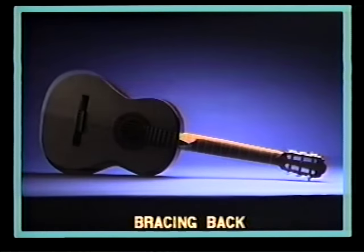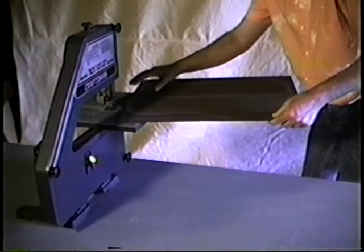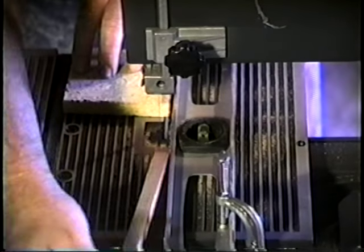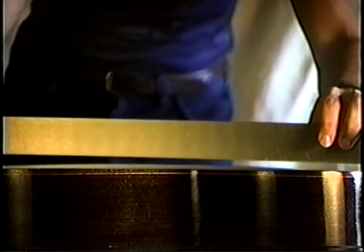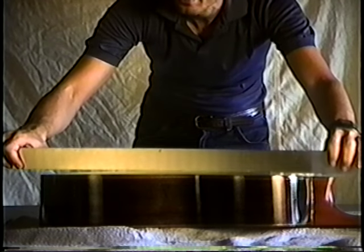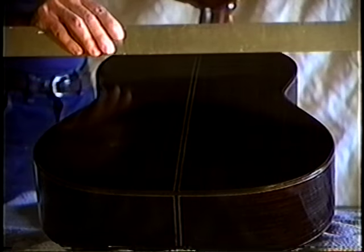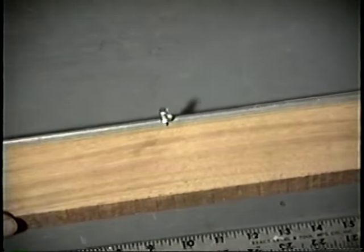The function of the guitar back is to reflect the sound created by the soundboard. To provide maximum amplification, the back is curved to a shallow bowl shape. We started by cutting the back slightly oversized, then installed a center reinforcing strip with grain running perpendicular to the back to prevent the joint from splitting. We made the back braces from mahogany using a straight quarter-sawn piece ripped on the bandsaw. The sides taper from the deepest part at the butt to the shallowest at the neck joint, so the waist needs to be curved more than the upper and lower bouts.